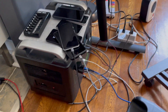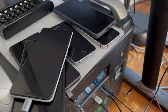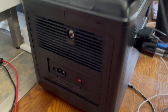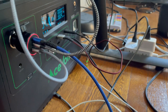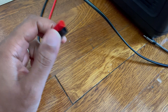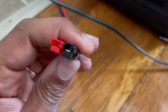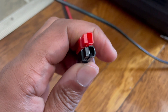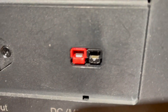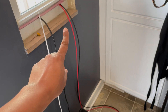This is on a 400-watt array. I was plugging things up as usual and it wasn't charging. When I tried to pull the wire out, the red one came out first, which was peculiar. The black one I had to really tug on — and that's ultimately the problem. Look at that — there's some heat damage, the thing is kind of warped. And there's even more heat damage here. So that connector is damaged, and that one is damaged.